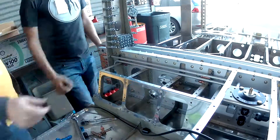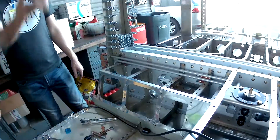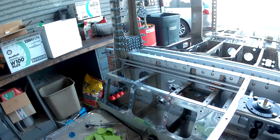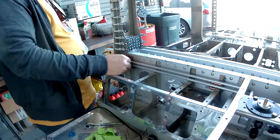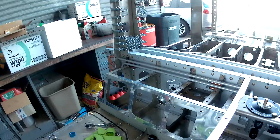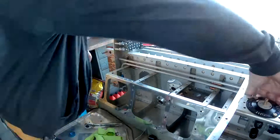And there they are — these are the two lines that I made, retrofit to the valve, as you can see. I'm so pleased. Now, there's one thing you don't see: if you look at the upper line, you can see it just kind of goes straight out and leans into the side brace. Right there, Van's has kind of put a hole for you to use — in case you're going to be returning fuel, this is probably where you're going to want to route it, and it fits damn near perfect. So all I really need to do is drill a hole there, the right size, and install a nice bung for the fuel. Then later on I'll need a second line to go from there to the return line of the tank, which is no big deal. Once again, Van's scores.